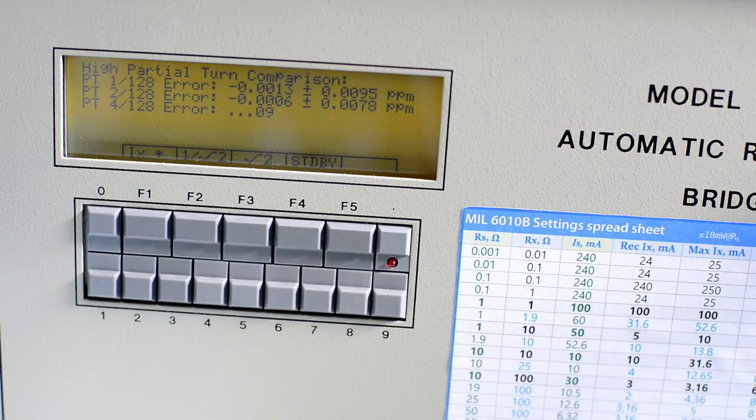And if you Google for the direct current comparator bridges, you can find a lot of different papers and research publications about how all this works and what their performance aspects are. There are older bridges sometimes available on eBay for somewhat reasonable money. For example, the Guildline 9975 uses the same principle but with much older hardware, like a galvanometer and some older parts and bits.